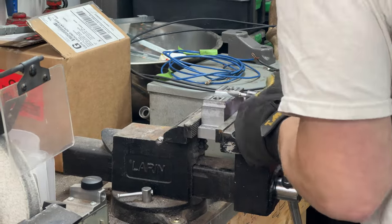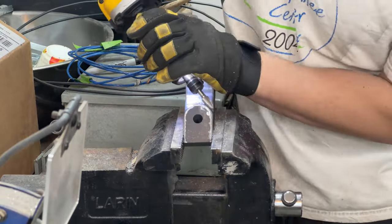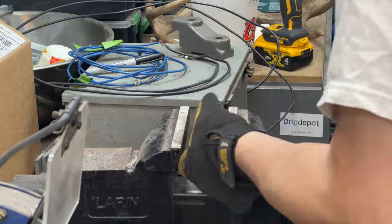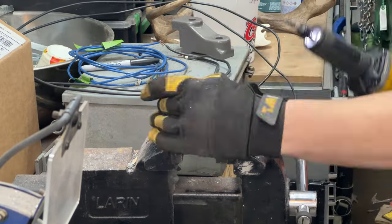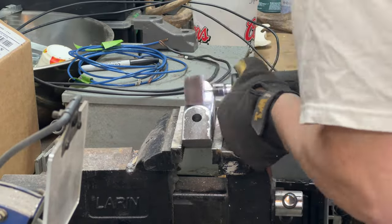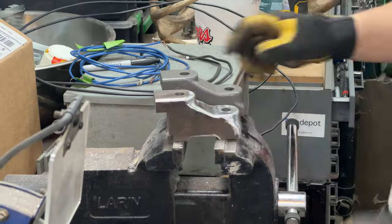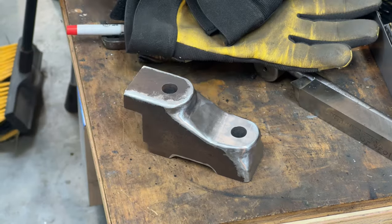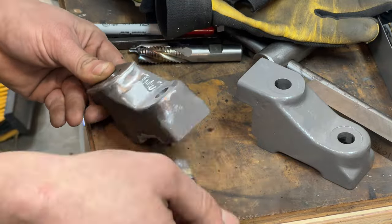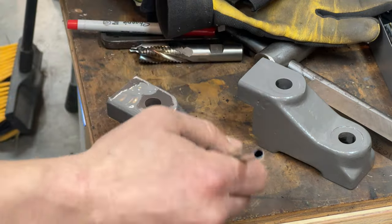The most effective way I found to shape steel was to use carbide burr bits in a die grinder. Once shaped to look like the original, a flap sanding wheel removed any tool marks and gave it a nice texture that is ready for paint. I then applied paint with an acid brush to all the non-machined surfaces. The bolts that hold this part onto the carriage are missing, so I'll get those ready next.